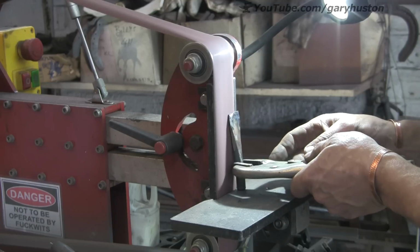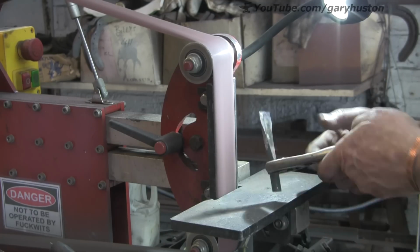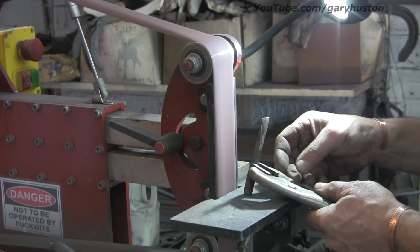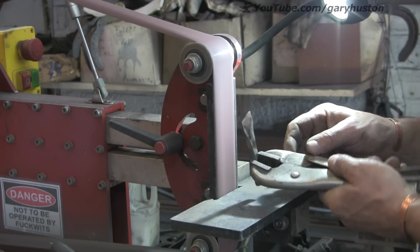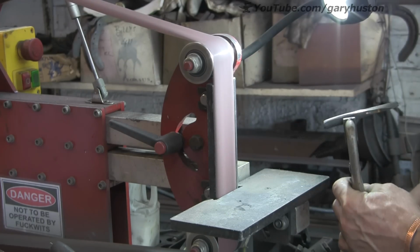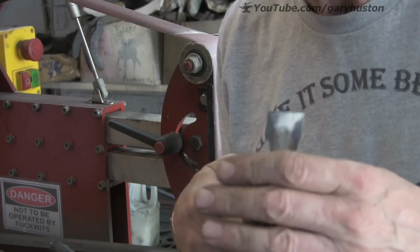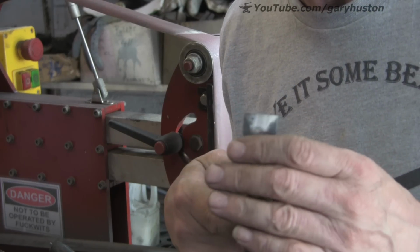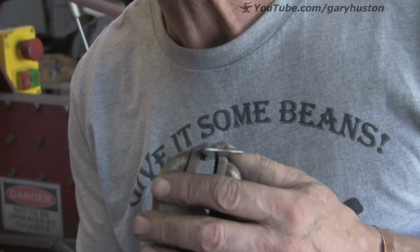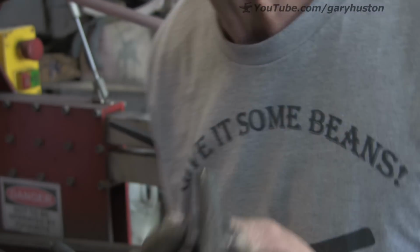Yeah, so if the taper is too steep and you try and use it, like if you're using it as a screwdriver, which basically this is, it would jump out of the hole because of the sharp taper. So I'm trying to keep it as long as possible so it doesn't jump out when you try and use it. And I think that'll do. It's not perfect. There, just about see it at the business end. It's about right, and we've got about the right thickness, about 1.5 mm.